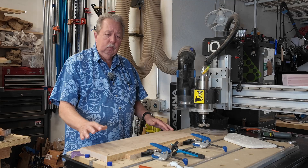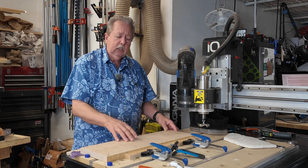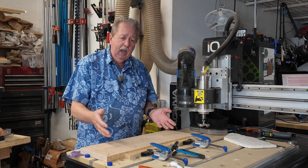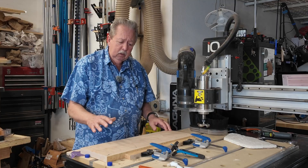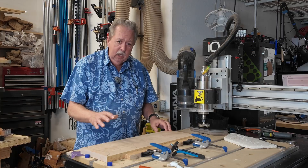As an example, I'm going to take this board down and flatten it. I've got another one matching it that I'm going to flatten, then I'm going to glue them together and make a flag out of it. So I want to take off the least amount of material as possible, and I find the CNC is the easiest way to do that.